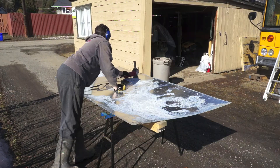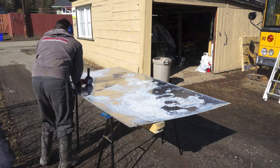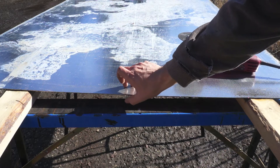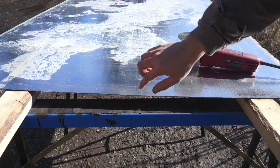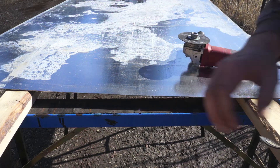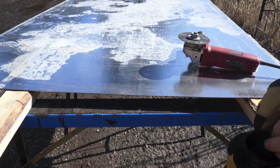Don't forget your safety specs — these ones are tinted. It's pretty rough here, so because this is a finished piece I'm going to take this grinder and ever so gently touch each side of this sheet to clean it up so that it's not rough like that. It looks a little nicer and it also will seal better. When we put a rivet through it, it'll clamp to the next sheet nice and tight.